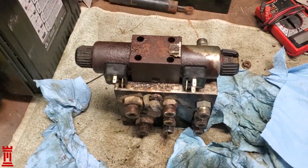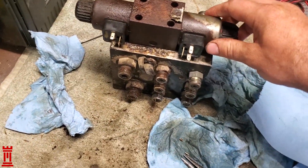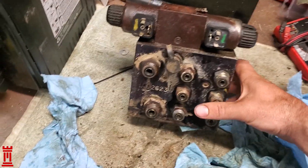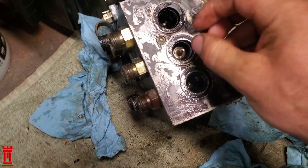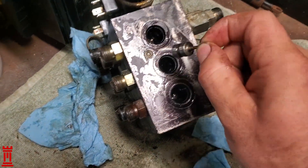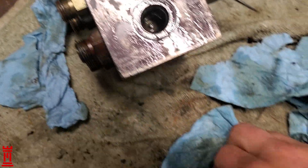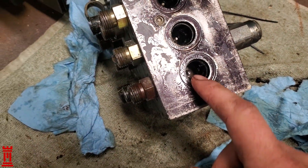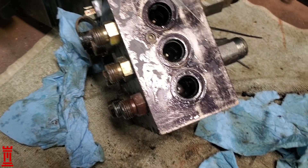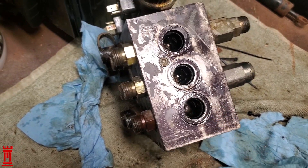Finally pulled that — hydraulic fluid does not clean up easy. Interestingly enough you can see through these if you clean the dirt off. There's a little warning light on there, neat. Looking in here — that's fine. A hydraulic valve looks like a miniature piston; they go in there like that. That looked fine, that looked fine, but this one did not look fine — two pieces of the control rod snapped off. Swapped check valves and the problem continued.